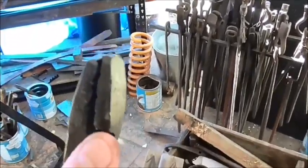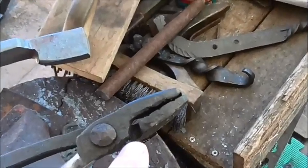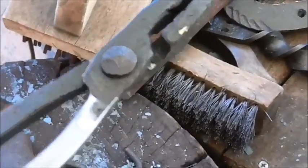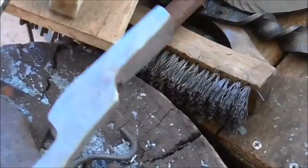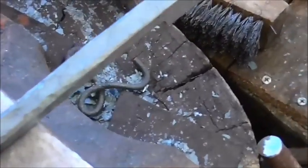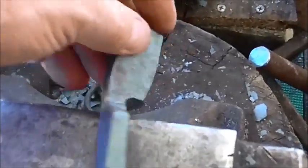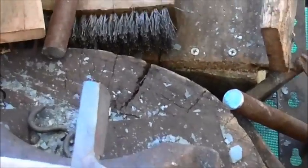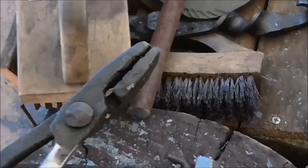These could be a little bit — if I look at it from down here, you want that area nice and flat along there, same as the other tongs, so that they articulate properly. These are those second ones I made — flat jaw. I think I showed you these, and I concentrated on the same thing with the jaws. See how I've got plenty of space up in here for the jaws to articulate. This is what Brian was on about — when you're there and you hit back on that second part and then you hit there, you drive this part back — driving that part back, which gives you that nice distance.